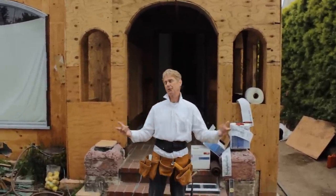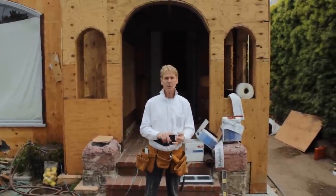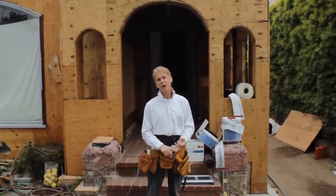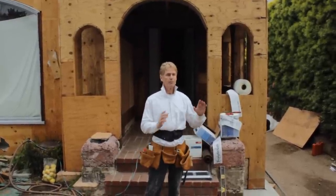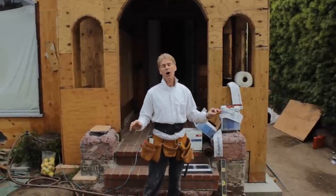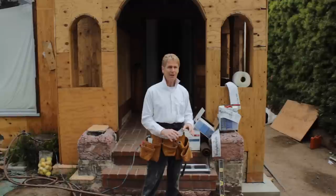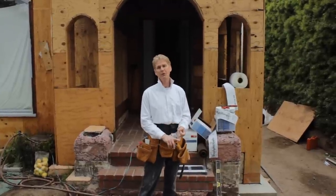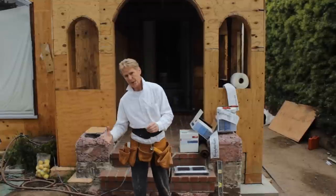And what we have here is a two-story house, and what we're going to do is the lath, scratch, brown, and a maintenance-free color finish. That just means like a brick, when you put it on the wall, it's forever. It will never come off. It's integrated with the stucco. That just means, again, it won't peel off. It'll last hundreds of years. Those are color coat maintenance-free finishes versus a painted finish.